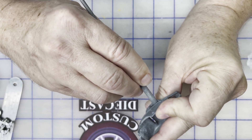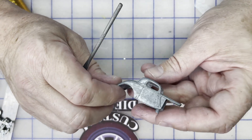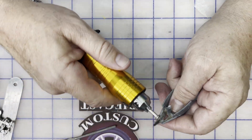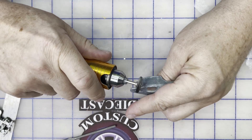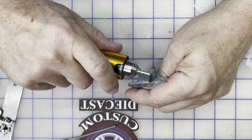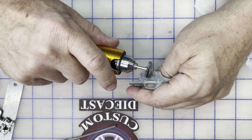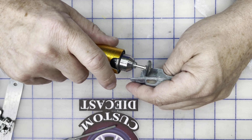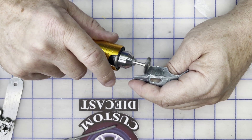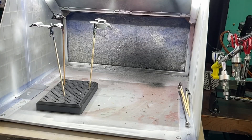I really didn't mention it - I went ahead and drilled and tapped that post. You need to do that before you put paint and everything on it, that way you don't mess up your paint job after the fact. Everything's cleaned up pretty good at this point. I'll use this wire wheel real light on here, then go back over and polish it out. If I see any gouges, we'll sand out what we can. If there are any real bad pit holes, sometimes I'll fill those - but this casting looks pretty good overall.